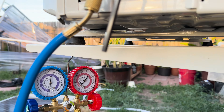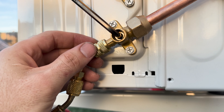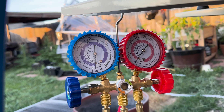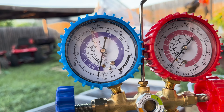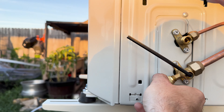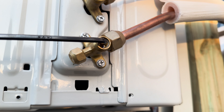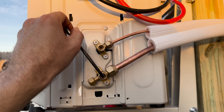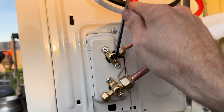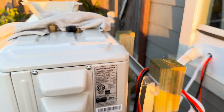Our vacuum is holding true. Now I'm going to crack this a little bit — if you have a full vacuum and go to remove the hose with the Schrader depressed, it's going to suck a little bit of air in. So I'm just going to crack this slightly to get a little bit of positive pressure, then pull this off. And that's it — we're done. Put your service caps back on, open the valves with an Allen wrench, and let the gas flow into the lines.